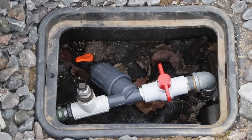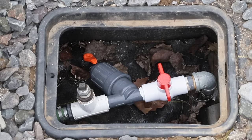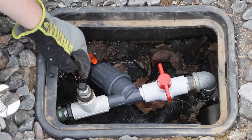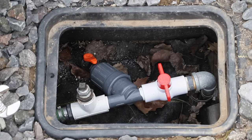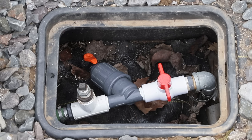To make sure I've got the pressure relieved off the system, I'm going to open up my filter valve. There might be a little bit of water that drips out the bottom — that's just making sure there's no more pressure. Next, we're going to remove the fitting that we're going to use to connect the compressor to the system. When I plumbed this, I used several different sizes so I'd have lots of options when connecting my compressor. You may just find a cap there, and you may have to build an adapter to plug in your air compressor.